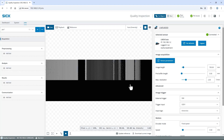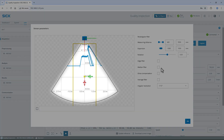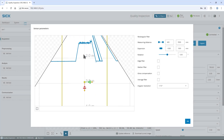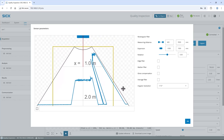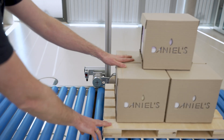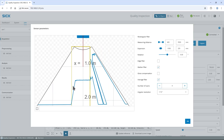Next, click on Sensor Parameters and see the 2D measurement data of the LMS4000. The black outer lines show the maximum field of view of the sensor and the blue line indicates the measured profile. Let's zoom in to see the conveyor and the floor on both sides. This view is great to verify the correct mounting of the device. When the stacked pallet is moved in, the two levels of the boxes become visible. As I can see some disturbances in my measured data, I activate the Median and Average filter. To capture only the relevant information, I adjust the region of interest to the belt width and align the far distance with the conveyor surface.